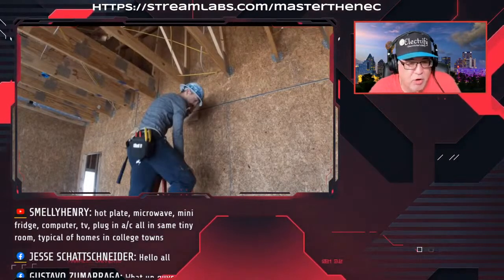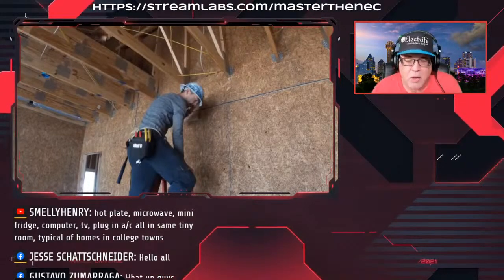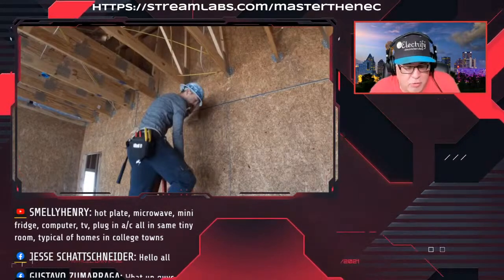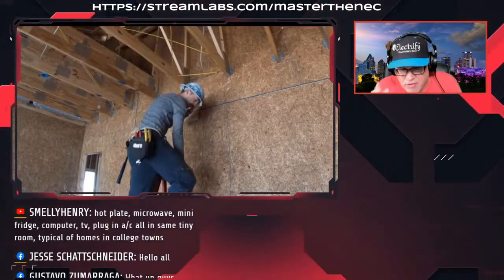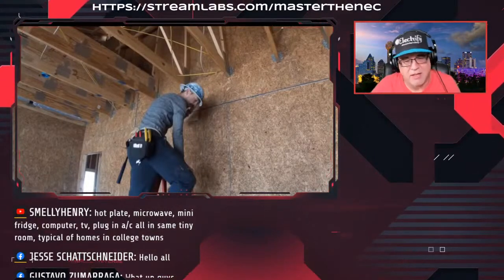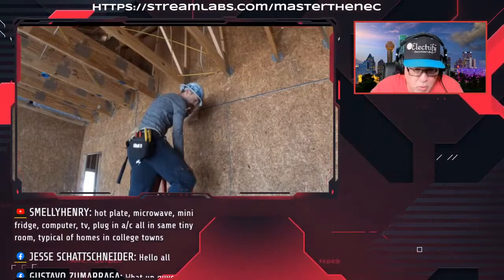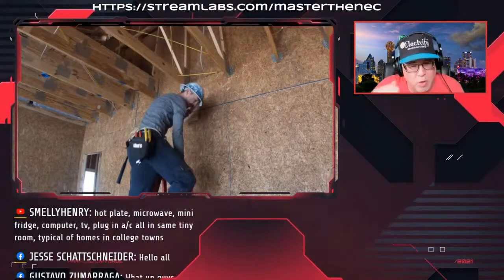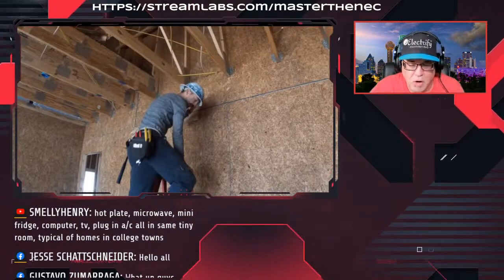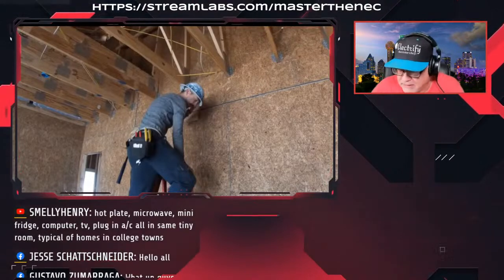Most of the receptacle, and we've talked about it in a previous episode, I think it's episode 4, we talk about, again, placement of those, and it's usually going to be in the International Residential Code, and it's going to give you ideas. Plus, you get a manual with the smoke alarms that tells you how far away from a peak you have to have it and all that. But placement-wise, the International Residential Code will tell you per floor, within 10 feet of bedrooms, one within each bedroom, and all those type of things are all something that you would cover in the IRC, International Residential Code.